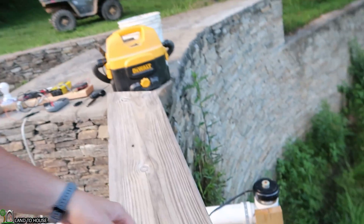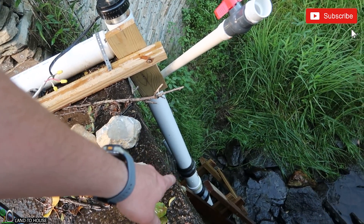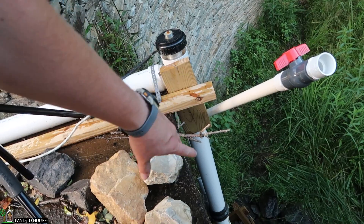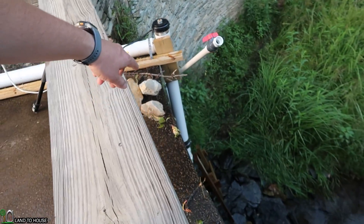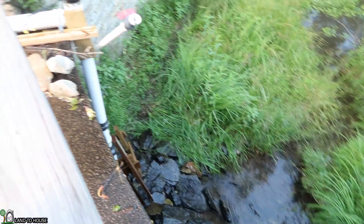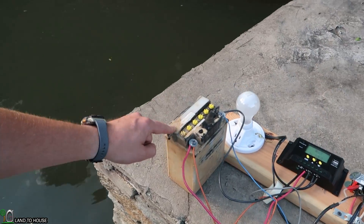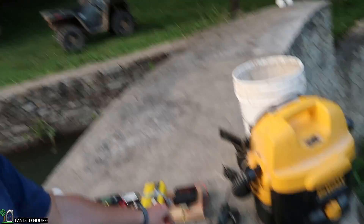The reason I'm making all these tests is so that Langston Alternative Power knows how this small four-inch turbine operates in a system like this. The battery system needs to be 24 volts. I just spoke with Spencer Langston and he said that the four-inch pipe going down here can only pull so much water, and the six inch that we added down there isn't really helping — so I need to step up to six inch from right up here. That piece of pipe is going to be rather expensive. I think what I'm going to do is take out the six there and then 45 over to the pool, and that should give us the full amount of drop possible here. With that, we'll hopefully see the most power, and I can also increase this up to 24 volts for even more. That is the plan for the next video.